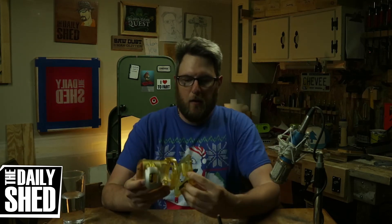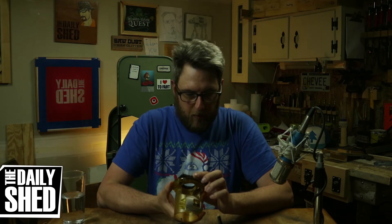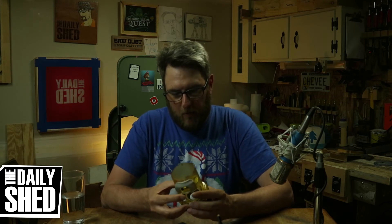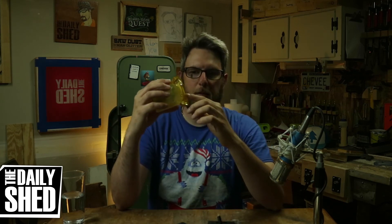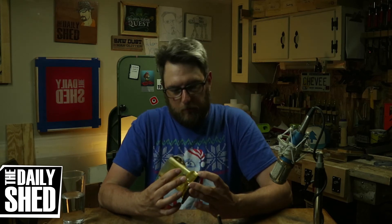On the original base plate, those slots go up inside the housing where you could put an edge guide. I've reprinted a base plate with holes where those edge guide slots are, so there's at least some sort of an eject hole in the bottom. We'll see if that performs at all. If it does, I have a thought that I might try to print one with a vacuum attachment — there's a little scoop on the back of the base, and if I make it a bit thicker I could thin it down on the back side and bring a hose attachment out to provide some active chip removal.